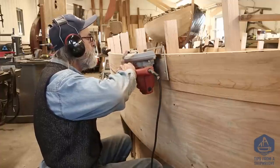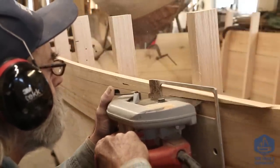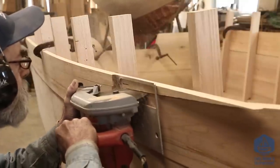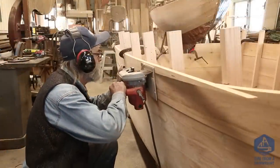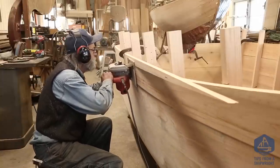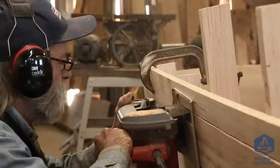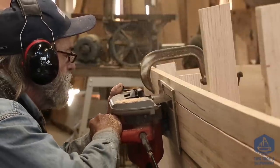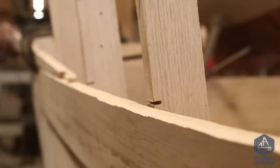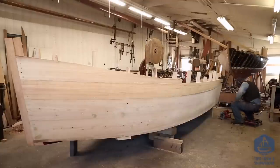Now I'm cutting along here on the starboard side from forward facing aft because that puts the saw in my hands in the right position - it's much easier for me to cut from right to left in this position. You just have to be careful because you have to stop once in a while and move a few clamps. I don't have that plank screwed on there all over the place so I'll move a few clamps, get by them and then clamp it behind me and continue on. Once I've completed, I'll remove that piece of scrap and you can see that I've cut into the frame heads just a little bit. There's a reason for that and I'm going to show you why I've done that a little bit later on.